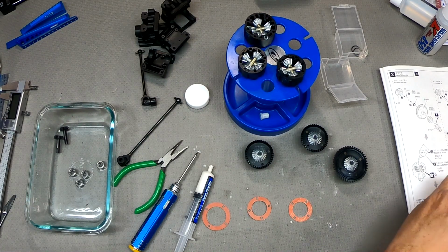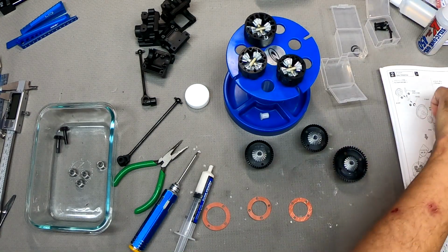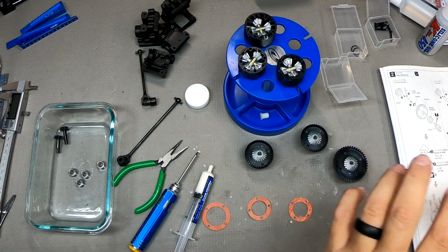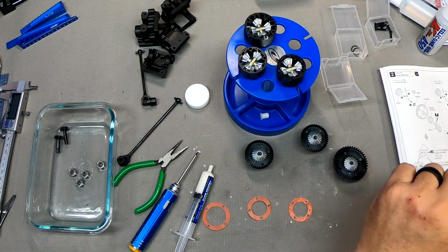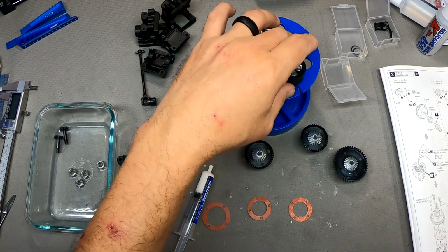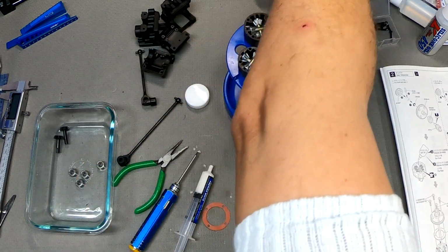So I'm going to start by screwing in and tightening these 4 screws in each of them. And then once they are sealed and closed, I will pull 1 screw at a time and replace it with the titanium screws. That way the threads will have been tapped, everything will be good to go.